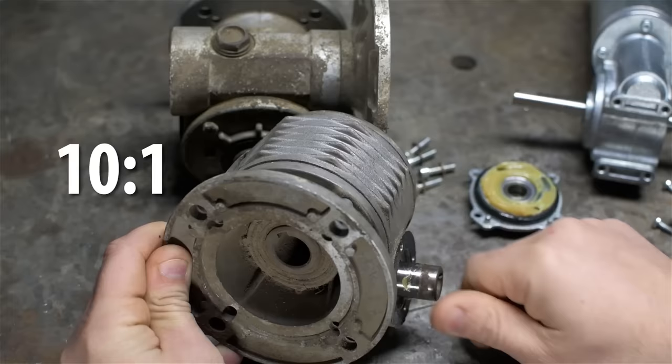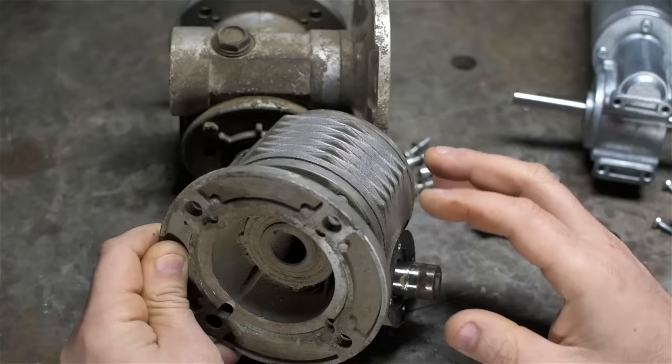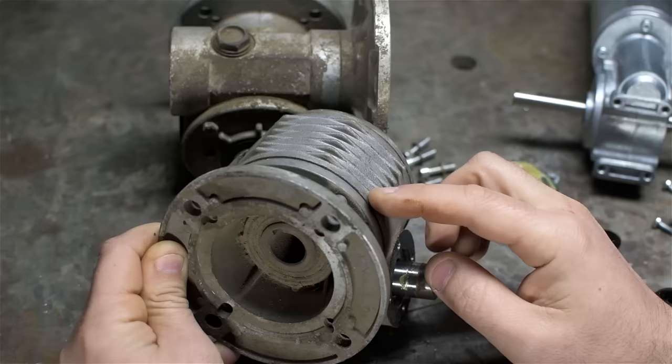Now, technically, I don't need a gear reduction with the motor that I have. I'm really only using these as a design convenience. Using this saves me quite a bit of trouble in having to build some type of a socket to mount the faceplate on, the bearings that those would be mounted to, and trying to attach a transmission between that axis of rotation and the motor output. That might make more sense as we're putting this together, but using one of these should save me quite a bit of time.